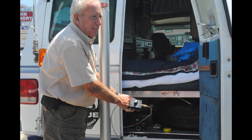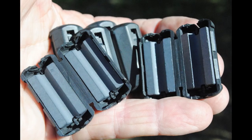So I like the coils because also, when we're doing the desert routine in January, Quartzfest, which is soon to be called Quartz Pause. But wait a minute, we're still going to be there. It won't be a Quartzfest officially. We're all going to get together, and when the wind is blowing, it creates static. Well, the coils will bleed off that static to ground right at the base of the antenna.